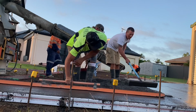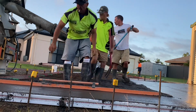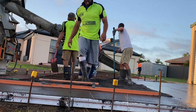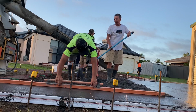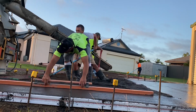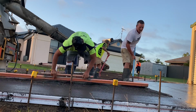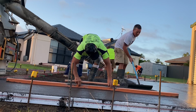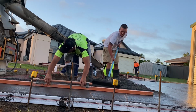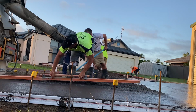And so you're always cutting stone down. You don't want to be low and close it up with no stone there, because you're going to have a ghosty bit in your concrete when you wash off. So the best way is to leave a little bit high, like 10, 20 mil high, and shave it back to the right height.